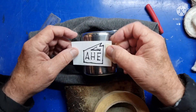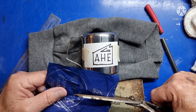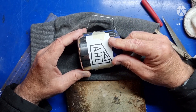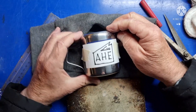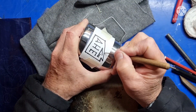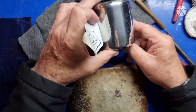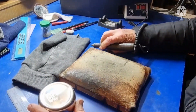There are many ways to transfer an image onto metal, but I find that if I get a logo that's a weird shape I can't do by hand, I'll photocopy it, then cut a piece of carbon paper and try to slip it in underneath — which doesn't always work. If it doesn't, I'll just pull it up, slip the carbon in, and that solves the problem. This is just a piece of dowel with an old burr stuck in it with a rounded point — you could also use a ballpoint pen. I usually get a better result than this; I think the carbon paper's gone off. Does carbon paper have a use-by date?